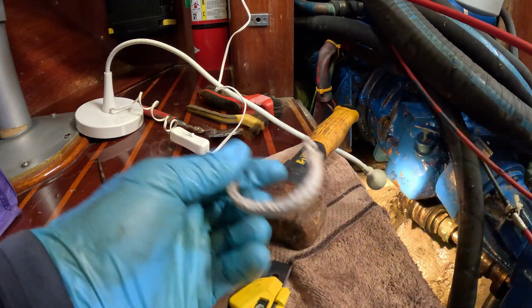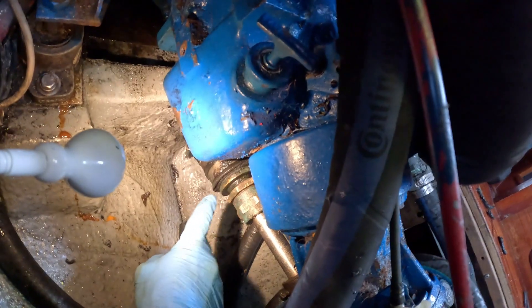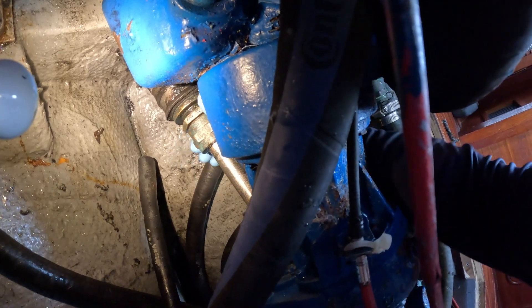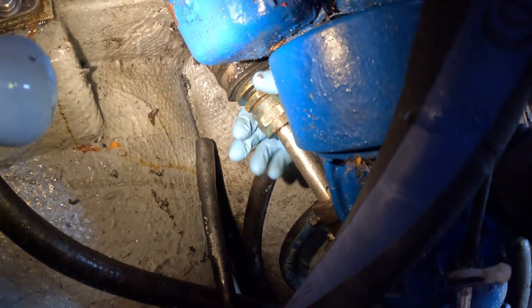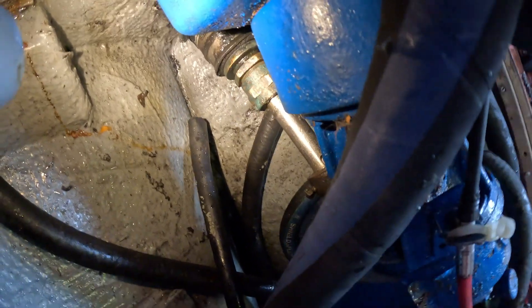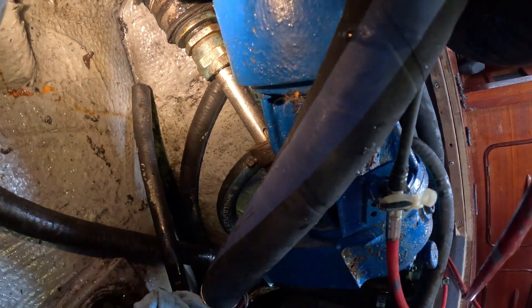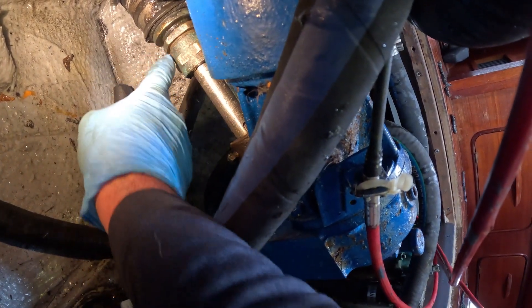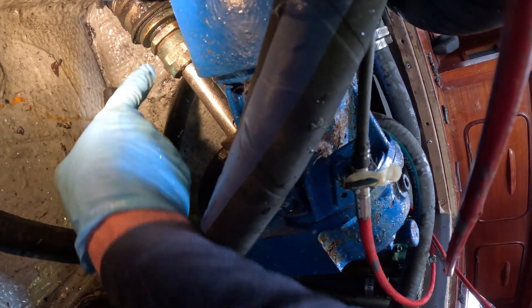At this point I want to show you that we took the first wrap and stuck it in. Remember I was moving back this locking nut and cleaning the threads off — I did that for a reason, so I had more room. I'm moving that locking nut back, which means this big nut here has room to work. There's the shaft that we cleaned. We put a strand of packing on here with waterproof grease and stuck it with our fingertips all the way around inside this nut to get a bite on the threads, then we screwed it all the way in, pushing that packing all the way to the end.